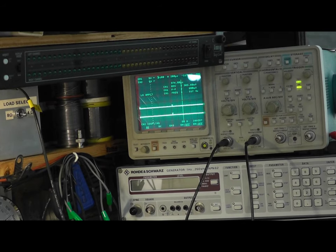And that's down to the linearity of the volume pot, and there's not much else I can do about it other than replace the volume pot. It's minimal, and it only affects very low level, and you can bring that back in with the balance control. So amplifier drive looks good, and into 8 ohms there doesn't seem to be any problem at all with anything nasty going on there. So the next thing I think to do is just to check the channels for distortion